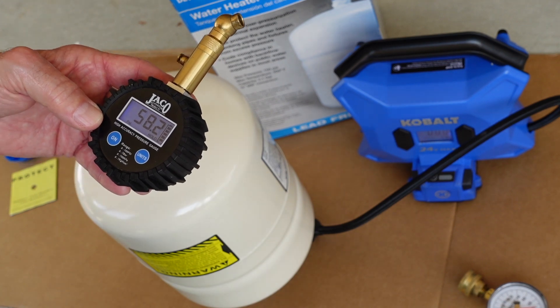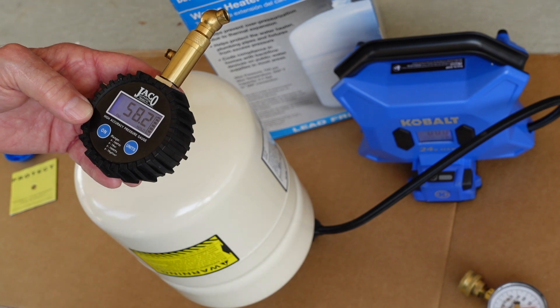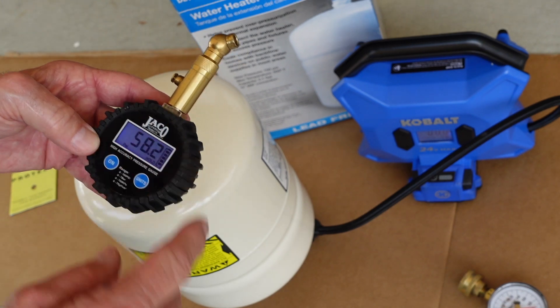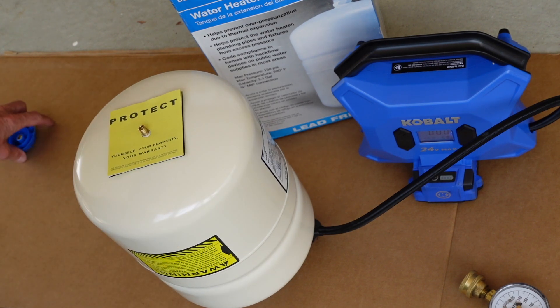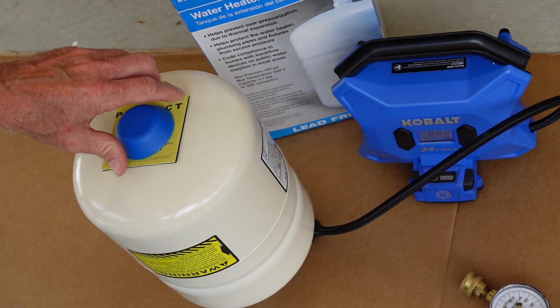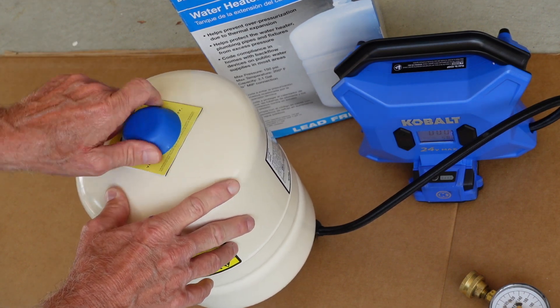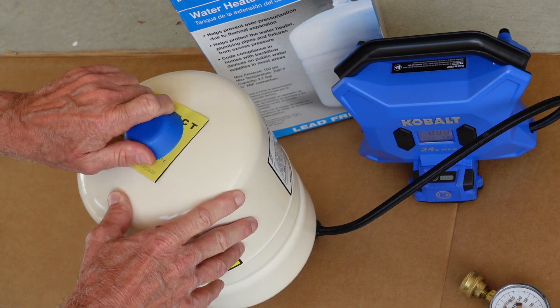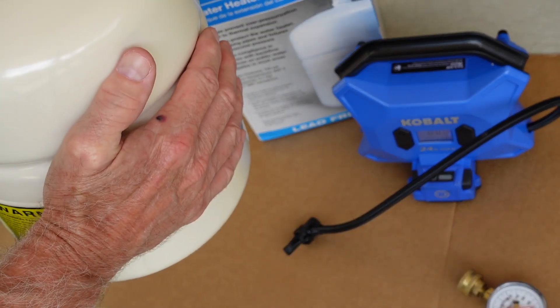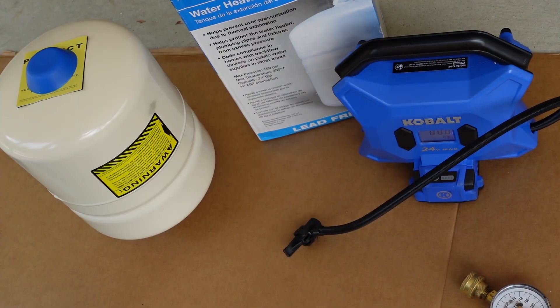Here's another thing to think about — this is going in the basement where it's often 65 to 68 degrees, so we'll leave it at 58 psi. Put the warranty cap back on — that's a threaded cap, put it back in its place. I like to mount mine vertical, straight up. You can mount them upside down, but however you mount it, keep in mind you'll need to access this valve cap to check pressure later. Thanks for watching — work safe and have a good one.